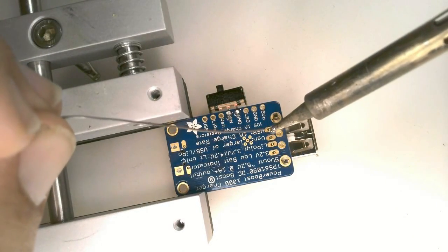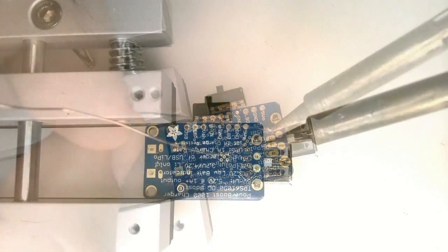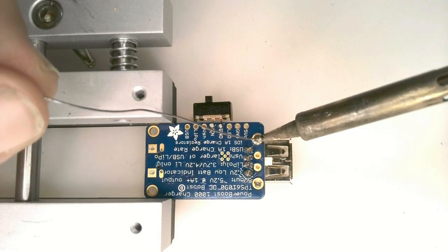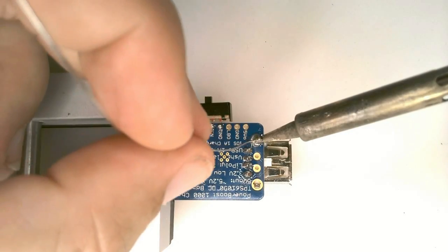There are 4 small electrical connections that you should solder first, and then 2 large mounting pins. These pins will take a lot of solder to fill the hole. Be careful, the component will be very hot afterwards.